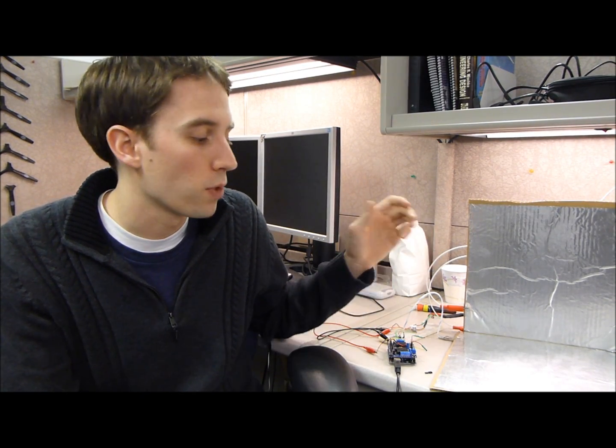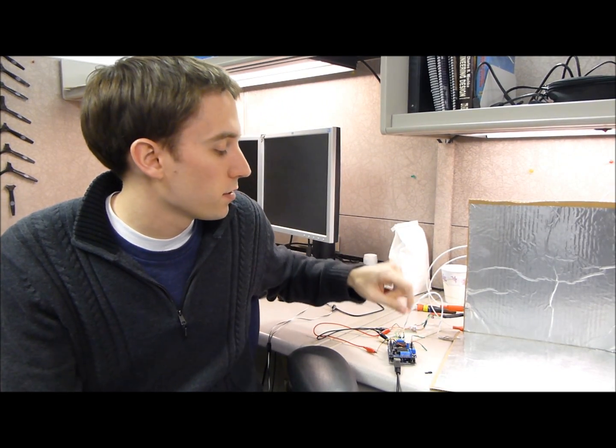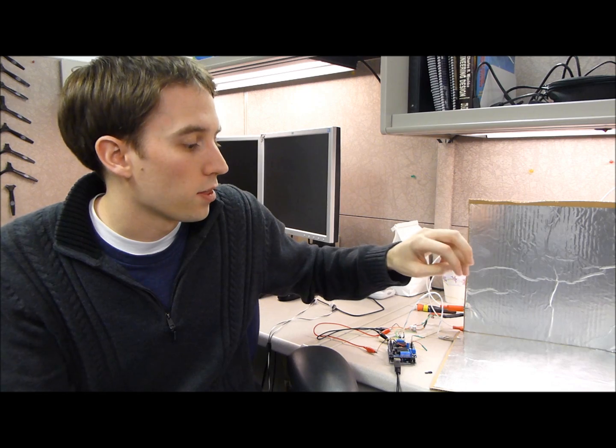So if I want to measure the distance of my hand to the plate, I can measure how long it takes a changed voltage to come back to the Arduino. The Arduino is actually sending a signal to each of the plates, and that signal is alternating the voltage on each plate. That alternate state is then coming back to the Arduino, and the Arduino is taking a measurement of how long it took that changed state to return.